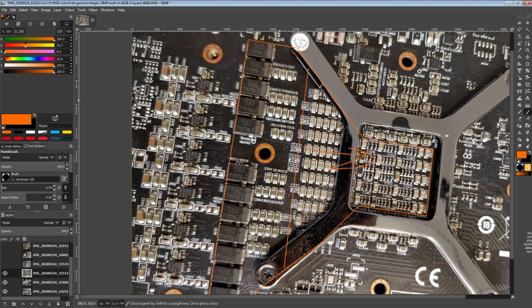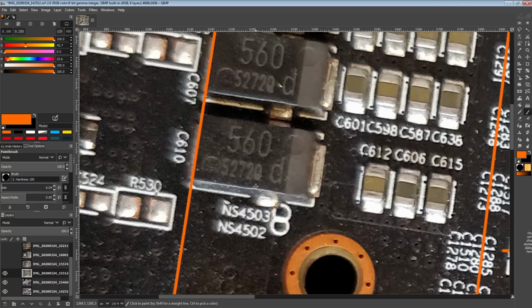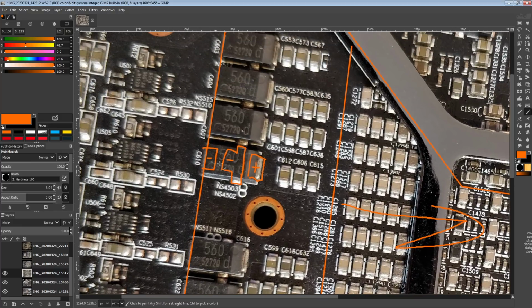But anyway, on the XFX or the reference PCB, we've got all of these 560 microfarad SMD aluminum polymers, and these are the really good type because they're the 3-terminal variant. You've got a tab right down the middle, and a tab over here. This side goes to VCore, and then you've also got one tab over there, so you've got your 2 ground tabs and your voltage tab. The 3-terminal package exists because it drops the ESL of these capacitors even lower. They're already much lower ESL than the regular 2-terminal variant, but if you want to spend extra money, you can get the 3-terminal variant, and the ESL comes down a bit more.